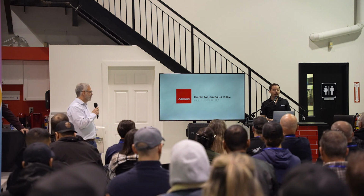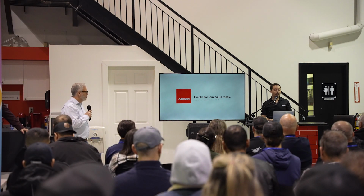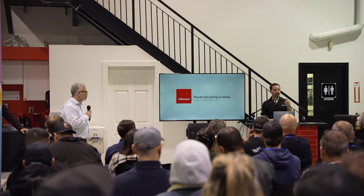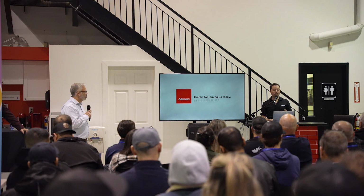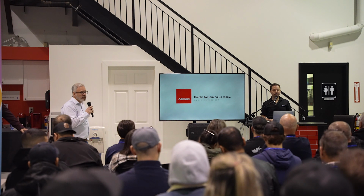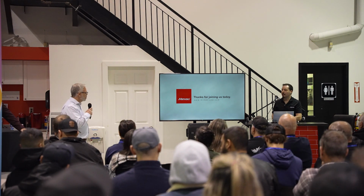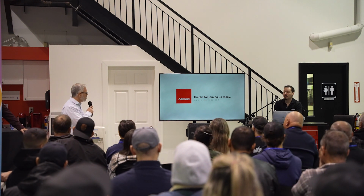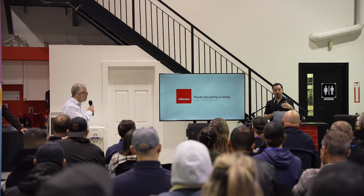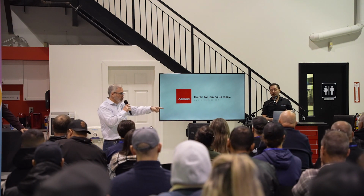Can you flush them? I don't think I've tried to wipe them down, and I find with that ink it's a little more difficult because as you're wiping it, it actually hardens. So you'll start to get some chunks, and what will happen is it'll go back onto the carriage. So I don't recommend wiping them. I would consider that a consumable. Now, there should be a scheduled maintenance list in the manuals. Can you confirm that? Yeah, I'll take you guys over to the manual, where you can find a service and maintenance manual that'll give you timing for everything. No, a couple more questions here.